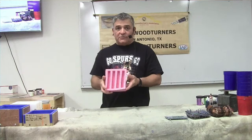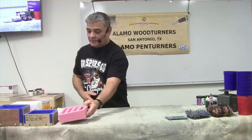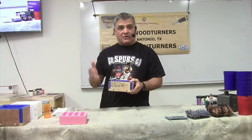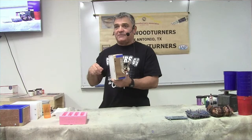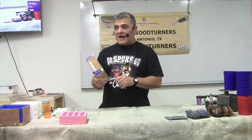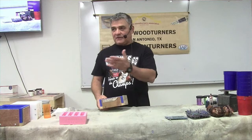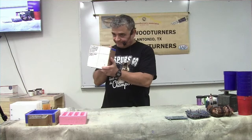You can also use individual molds. Their advantage is you don't have to cut blanks to size - just get them out, square them up, put them on the lathe and start turning. With block molds, once it's cast you have to cut them on the bandsaw or table saw. I put tick marks on the back of these molds - I need to get 100 iterations out of each block to meet my business plan. If I get less, my cost per blank increases; more than 100 and it decreases.